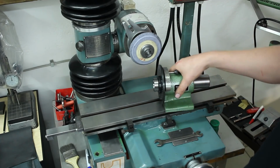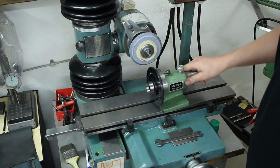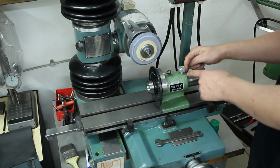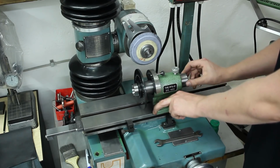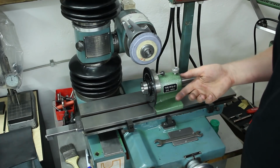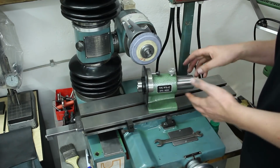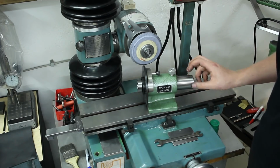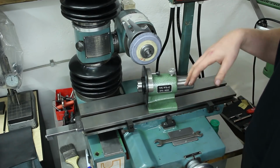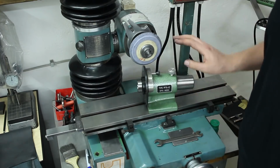And then we have this piece of tooling. This did not come with the grinder, but I bought it on sale for about 50 bucks. It's one of those inexpensive 5C spindexers. Most people just use them as a dividing head, but you can also, when you remove the screw-on collar back here, get an axial motion. That means you can use it, for example, for tool and cutter grinding. Grinding the flutes of an end mill. If you add a master thread and a chaser attachment back here, you can also do thread grinding with it, or axial back relieving of tools that you want to grind. For example, you would grind a tap on front with an axial back relief grind, and that's something I want to build with this guy here.